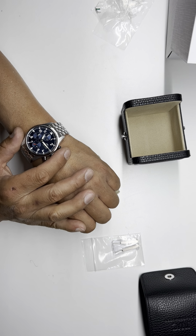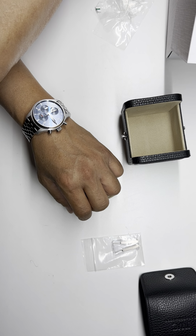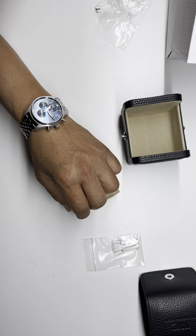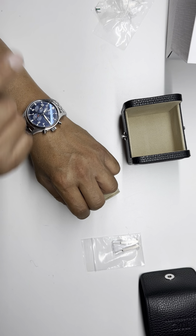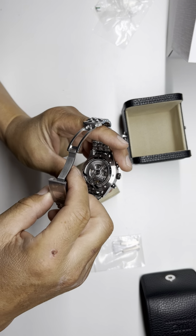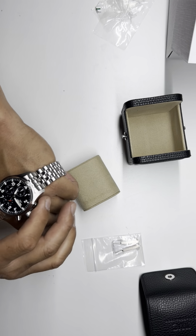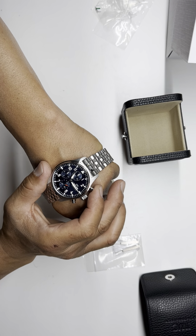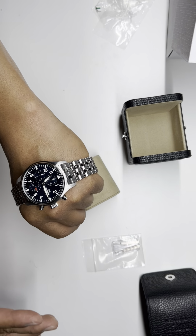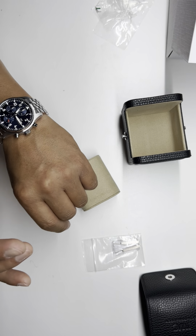These are the accumulators for the chronograph. However, I really did want this particular movement because of the column wheel. This is a column wheel chronograph. What you're going to get with that is, when you push these buttons to start the chronograph, stop it, and reset it, it's all going to feel the same. Every single click is going to be dialed in. It's going to feel exactly the same, not indifferent in any way.